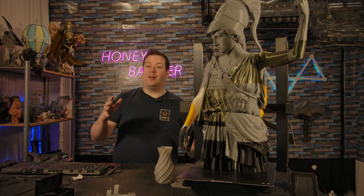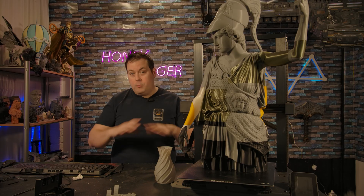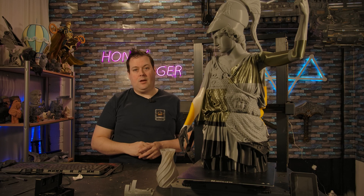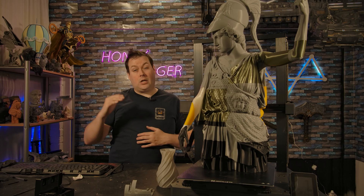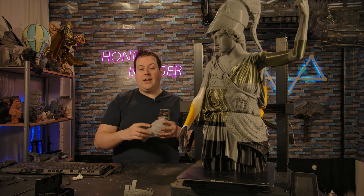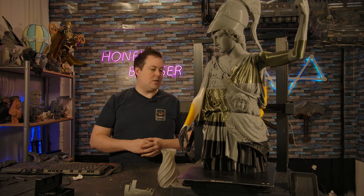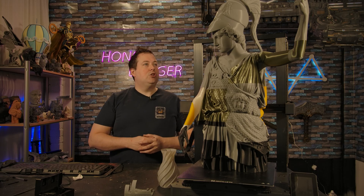Print quality is actually really good. Everything was printed at 0.2mm layer height — almost everything at 150 to 200mm/s. The vase was 200mm/s and Athena was at 150. I found that pushing past 150mm/s the part cooling started to struggle. Flow rate wasn't a problem, so for vase mode or minor overhangs you can push a little faster. Past 200mm/s I was seeing Y belt slip and layer shifts, so 150 is where this machine is super comfortable and prints lovely all day.